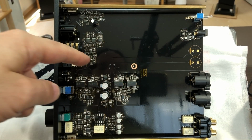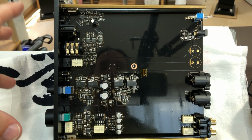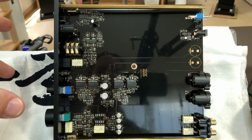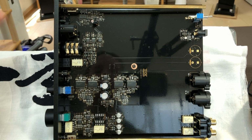There's more than enough room for a transformer in the power supply, or basically the contents of the wall wart, even if it was just a switching power supply, as presumably the wall wart has. But they've decided to go for a wall wart, and I guess the whole amp relies on its feed-forward kind of active negative feedback circuit to minimize any distortion caused by the power supply or any other design simplifications. And it's very apparent to me in the design.